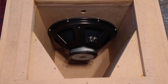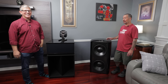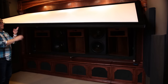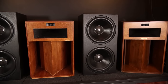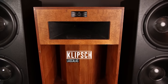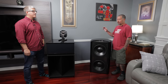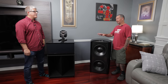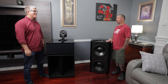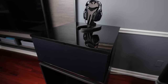You don't have to have a subwoofer for most music, but I'm a bass head so I like a little more. I used to have three LaScalas and they don't really dig that deep. By making it ported, these go down to about 30 Hz — tuning is about 32 Hz. With a little DSP I've got them boosted around 17 Hz. They'll get into the mid-to-low 20s before they get nasty.